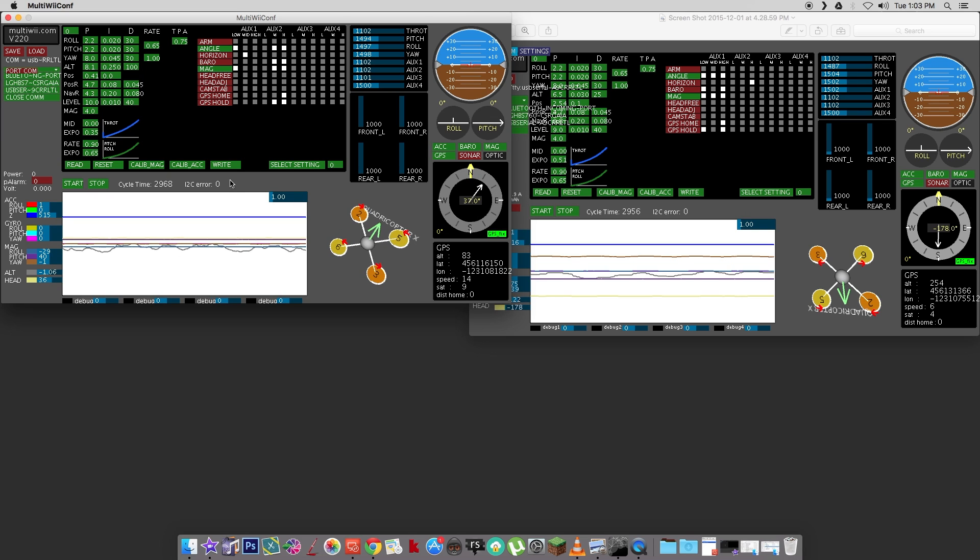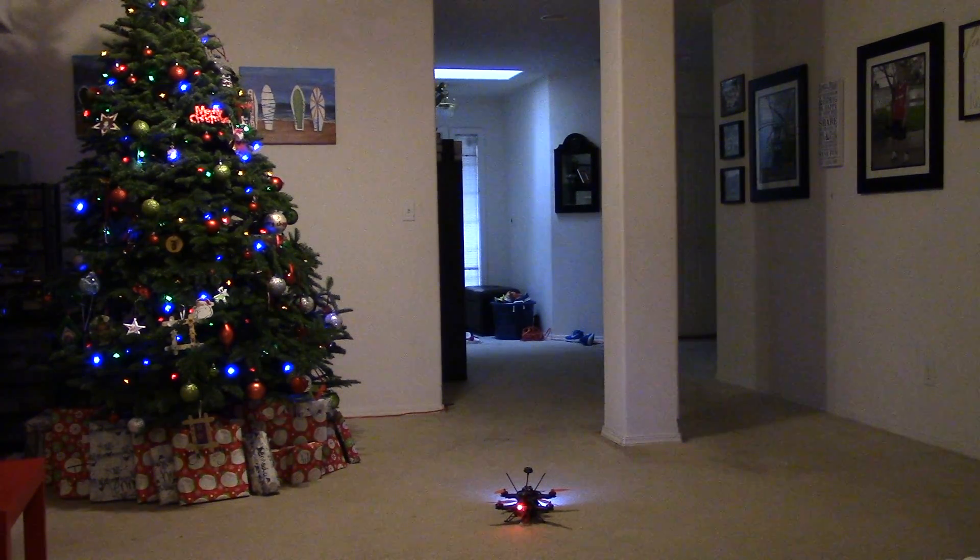Next you guys will see some video of how those flight modes are working. We're going to do a quick test flight to show you what I've programmed through MultiWii — basically stable mode using angle on mix switch option zero, and then when I go to mix switch option one, that'll be my acro mode using horizon. We'll start off in zero, which is angle and mag, and show you how that flies. Just arming the motors now, and we'll go ahead and fly.